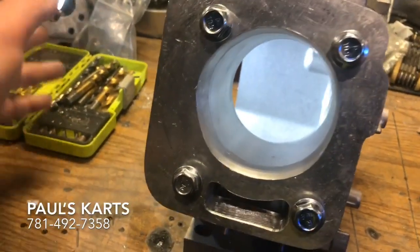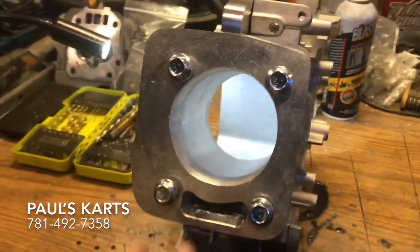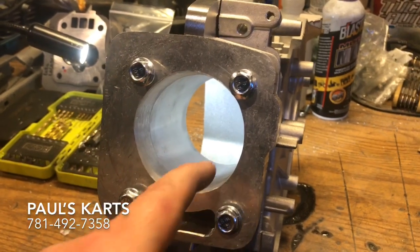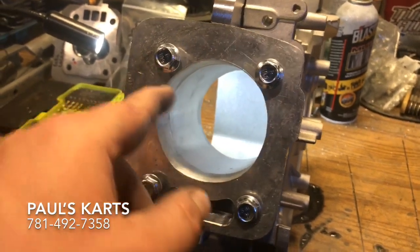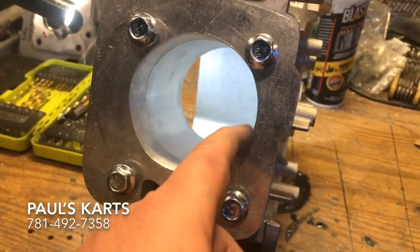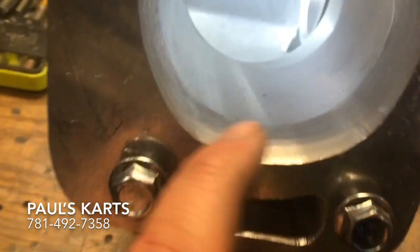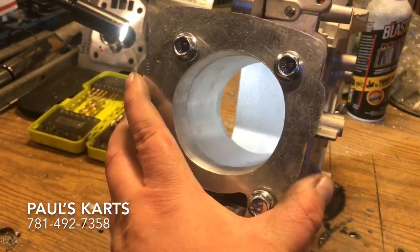Got the bore taken care of. Got the center hole drilled out. What I did for this was we ended up getting the correct head gasket. Put that onto the 1-inch deck plate. Traced the circle, and then went through with the drill press for a couple hours and drilled a series of holes intersecting each other. Took the middle piece out and then followed that along with a jigsaw to make it somewhat of a circle instead of looking like a saw blade, inverted saw blade. And then going over that with a sand roll, cartridge roll on a grinder.